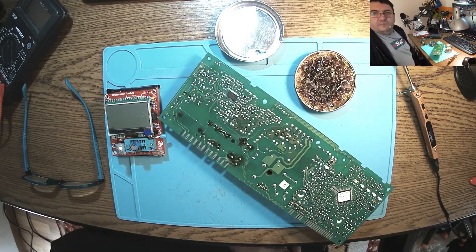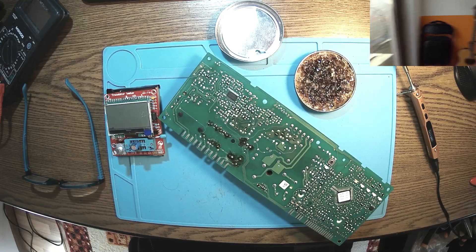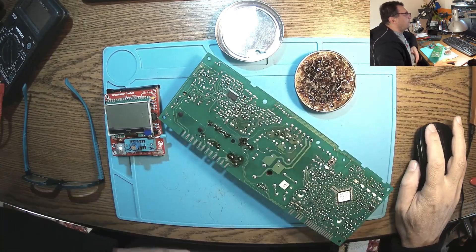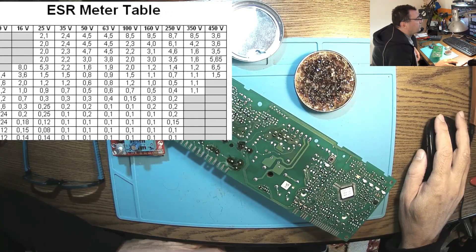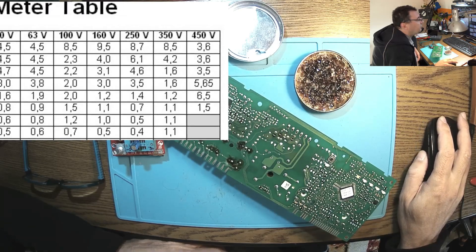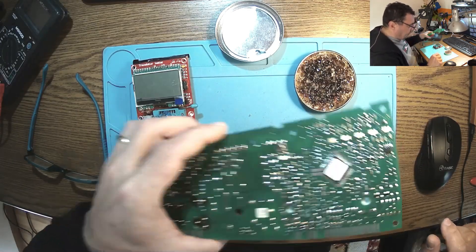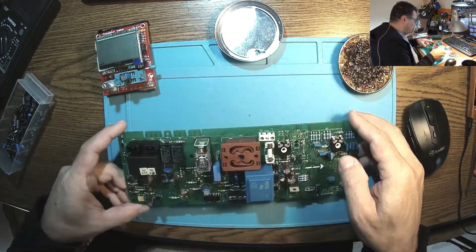Okay, sunshine. Look there, guys — maybe I got some solar production. December was absolutely not that, 25 kilowatts for the whole month. Anyway, I said I'm looking for some ESR charts. So for 1 microfarad at 400 volts we should be around 3.6 ohms. Not 90. This is so bad. Very clear — first bad capacitor. So maybe I should try 3.3 at 400. This is in the air — I have to write this down.